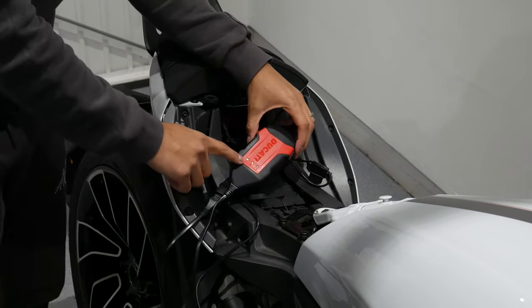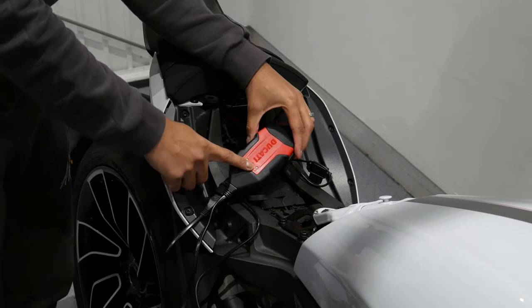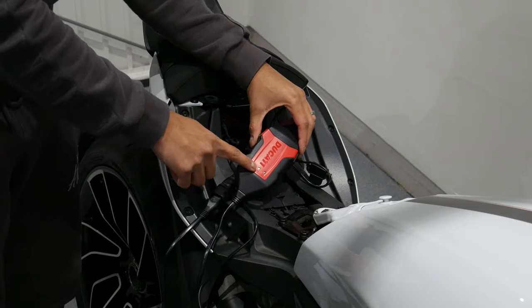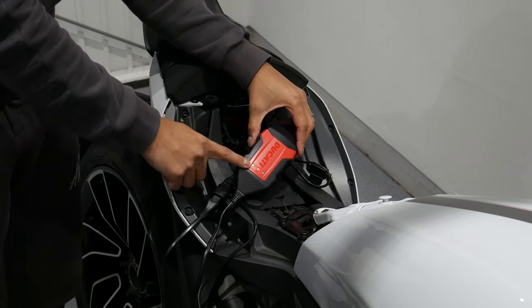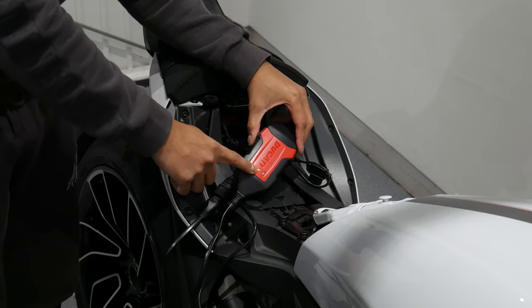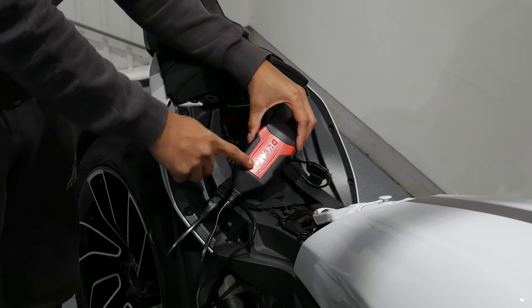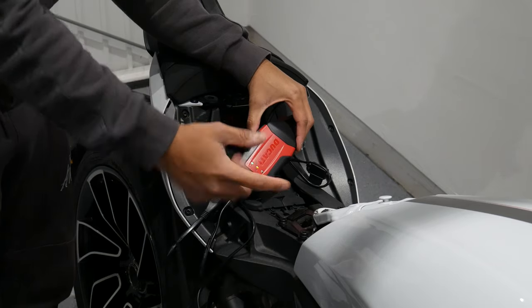So I've checked the manual, and basically that third one, if it goes on, means it's in maintenance mode, and it's checking the voltage levels of the charger once it's run its full charge cycle. So you've got green to signify that it's receiving power from the mains outlet. A solid amber means that it's doing the bulk of the charging for the battery. If it's blinking, that means it's trickle charging. And the last one, if that's on, it's in maintenance mode and doing voltage checks. And that's pretty much it, really.